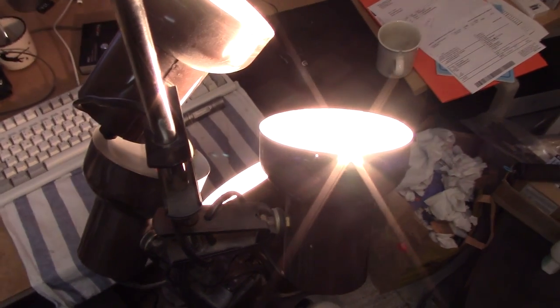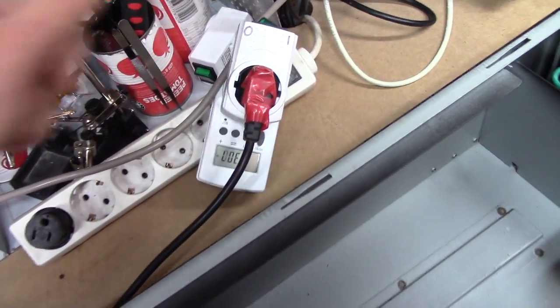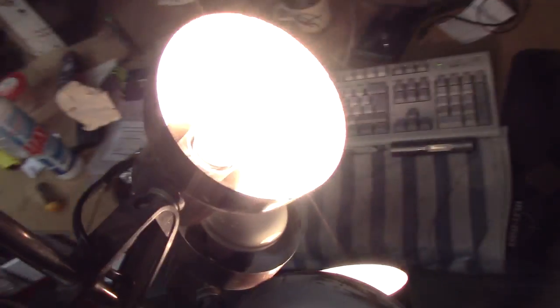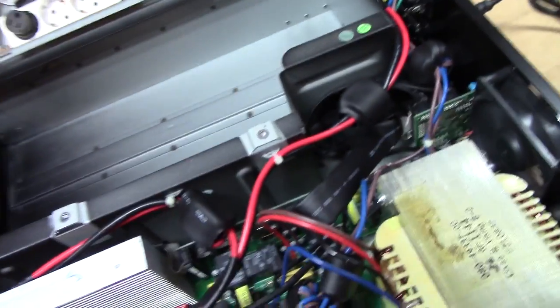I guess I'll just have to put this thing into use then. Can I actually power anything? We've got 160 watts of light bulbs in there. I don't know how fresh the battery in that thing is, but we'll give it a go. Hang on, we're actually drawing 300 watts — shouldn't be drawing that much. Oh, we've got another light there, that explains everything. That should be 160 watts. And yeah, 211 in and this thing idled at about 60, so let's see what it does.